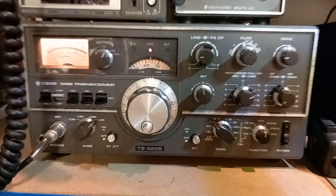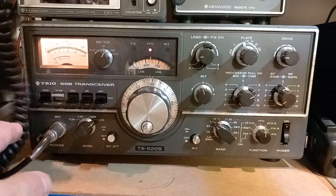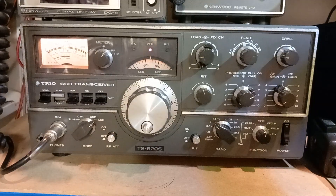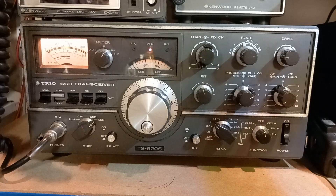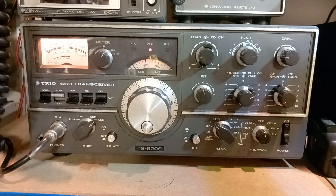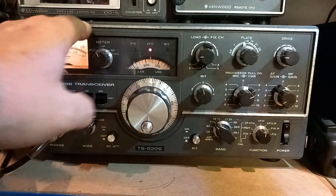So we should be nicely warmed up. The first thing we want to do is set the ALC. The ALC relates to the pre-driver valve — you're altering the grid. The drive level needs to be set. We switch this knob up here to ALC and we're looking for a reading in this arc. Then we switch the mode switch to Tune. Tune will limit the output to around 10 to 20 watts depending on your state of tune. You can use the microphone to key up, or you can use the send switch.